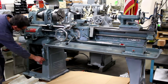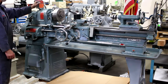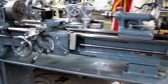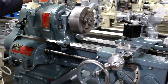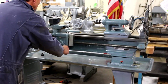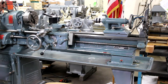This machine has 13-1/8 inches over the bed — a 13-1/8 inch swing over bed — and 40 inches of distance between centers. The maximum swing over the cross slide is 7-3/4 inches. We're currently running a four jaw on here. The low range RPMs are 40, 60, 90, and 135.